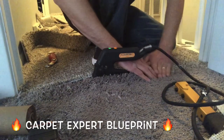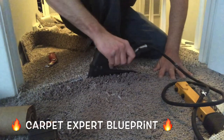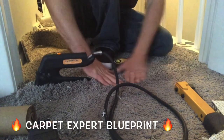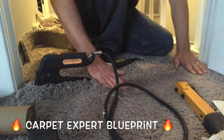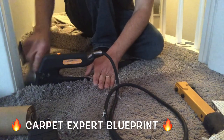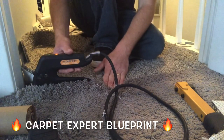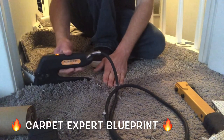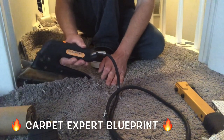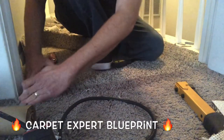Go ahead and put those two together. Blend them in. This is the best way to start because no matter what, you know there's a seam there, and it's easy to hide a seam when it's two totally different carpets. Let it go all the way to the other side. One of the tricks you've got to pay attention to is getting the iron out without pulling the seam tape with it. So take your time and just do this nice smooth swoop action. Just slide it forward so you don't pull the tape out and get glue all over the new or old carpet.